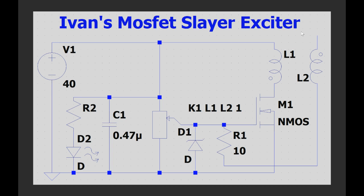Now a MOSFET, unlike a transistor, is a voltage-driven device, meaning that it needs pretty much no current on the gate to turn on and off. Which also means that as a general rule, they can switch faster and are better suited for driving higher power radio frequency loads, such as a somewhat medium power solid-state Tesla coil.